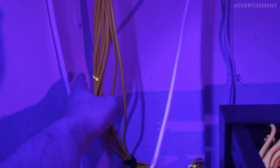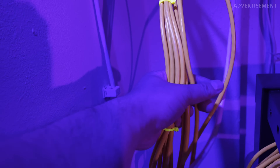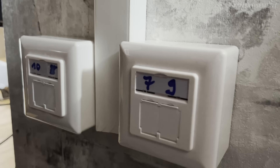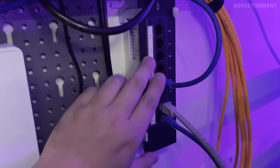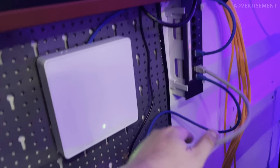Here's how I've done it: I ran additional ethernet cables across the living room and the studio. Instead of only having two ethernet cables going to the living room, I now have six, where I can connect many different devices such as my router, an access point, TV, and consoles — much better than having them all on Wi-Fi. And instead of having just two cables going to the studio, I now have four, to connect an additional access point, my computer, a printer, and a laptop. I also added a small eight-port patch panel to the wall in my server room for smaller devices like smart home bridges, a Zima board, a Raspberry Pi, or an access point. These eight cables also go right into the server rack, so in total I now have 18 cables connected to the front patch panel: six to the living room, four to the studio, and eight to the wall mount.